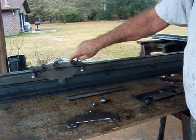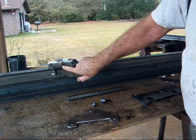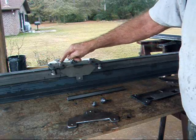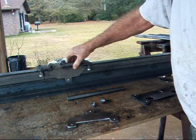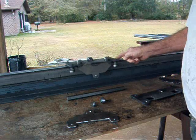As you can see, it rolls real nice. They're all adjusted by this screw here — put a wrench on and turn the bearing assembly until you snug it all up. And it's very tight: can't twist it, can't pull it up or push it down or sideways. And it moves real easy.